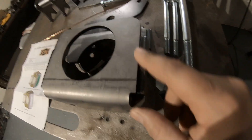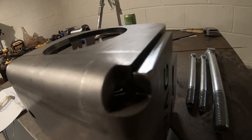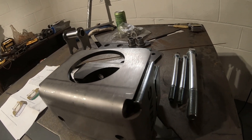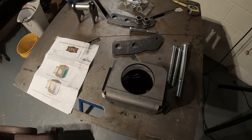In this video I'm just going to show you me going through and finishing all these welds. I'm going to weld everything because it's a bit of an awkward angle — almost like an outside corner. I feel like I'm going to try to do a freehand weave on here to fill it across each plate equally without getting too much reinforcement on there. So let's go ahead and get this weld going and see how it turns out.